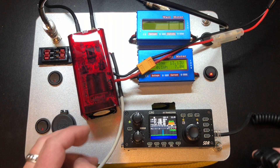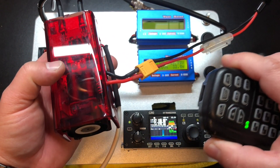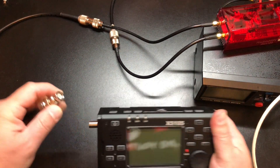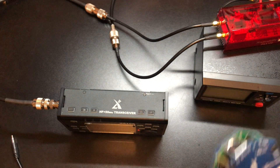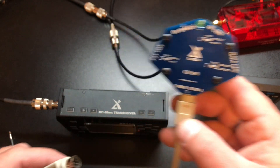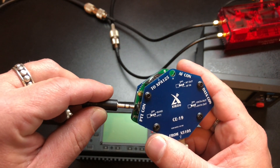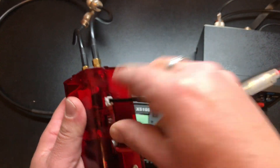Before we get to the X5105 setup, I just want to show you that's all there is — we've got a nice little fan here spinning. Push the PTT — it's working, it's powering up. Now, to hook this up to the X5105, mostly the same steps as before. We've got our antenna, but we have to use the CE19 interface. We're going to take the cable that comes with the CE19 interface, plug it into where it says 'from X5105,' and on the side of the X5105 we'll plug that in. Then from the PTT connection, we're going to take this tip-ring-sleeve 3.5mm jack, plug that in, and then this plugs into our PTT.